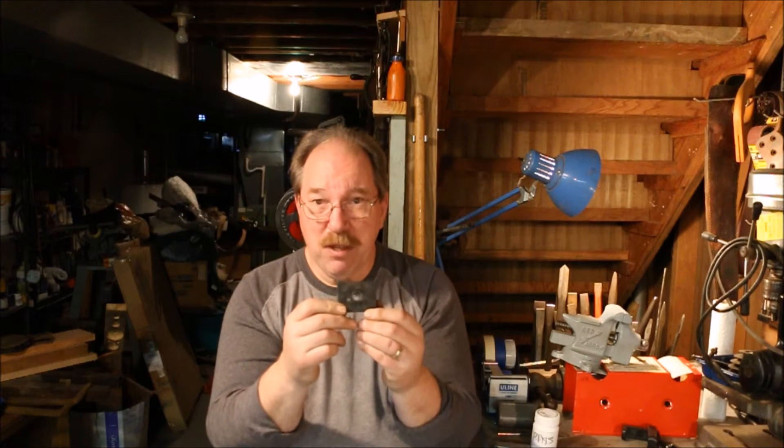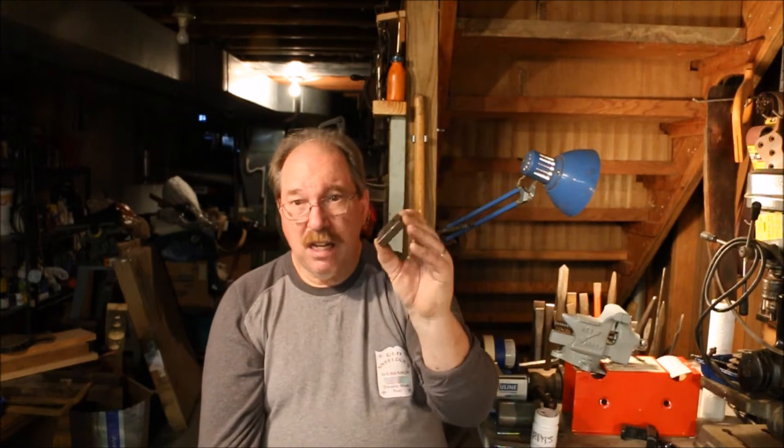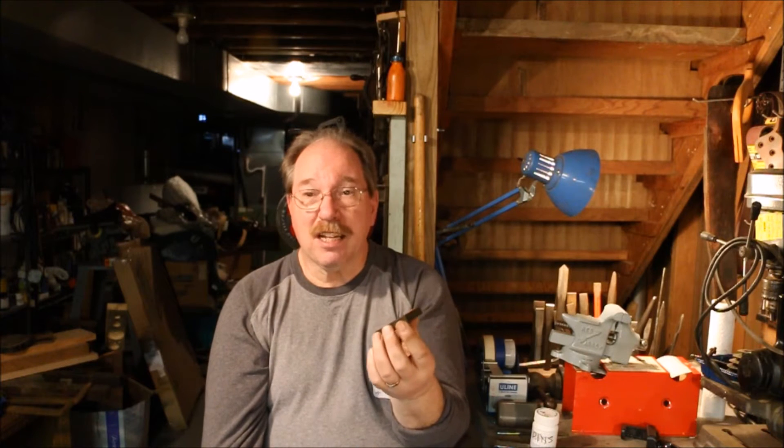This is the AXA block that came with the AXA tool post. It's set up so that I could cut it to size to fit my lathe because it kind of matches all different kinds of lathes. They do sell a South Bend T-nut, but I have a threaded block, a hacksaw, and all the stuff to mark it out — it's just a matter of cutting it. Today's project is to cut this T-nut, then set it up in the lathe and use my milling machine apparatus to mill it to size. If I'm careful I can cut it almost to size and then maybe just file it down a little bit. We'll see if I can do it manually first because that's a better challenge.